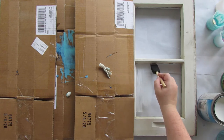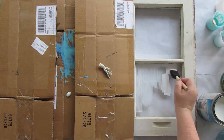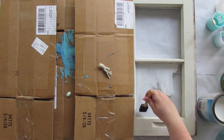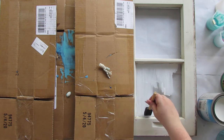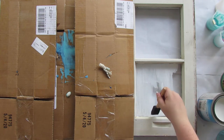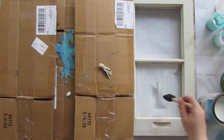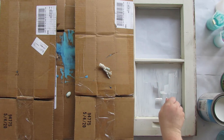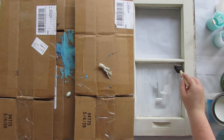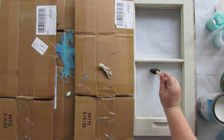Starting, we're going to actually prime this baby because chalkboard paint works best over primer. This is just a multipurpose primer. We're going to put it on with a foam brush. It's not going to look pretty because the first coat of anything never looks pretty. That's okay. We just want to make sure it's thin. The point of fabulousness with chalkboard paint is thin coats. The more thin coats, the better. Don't do thick coats — just spread it out as thin as you can. Make sure you're going from corner to corner and spread everything out.